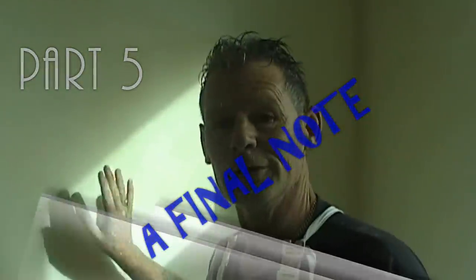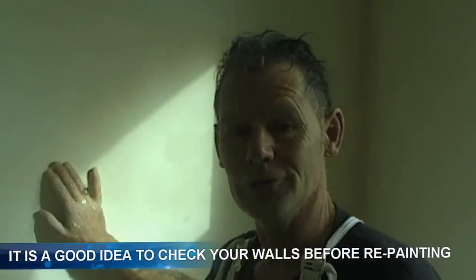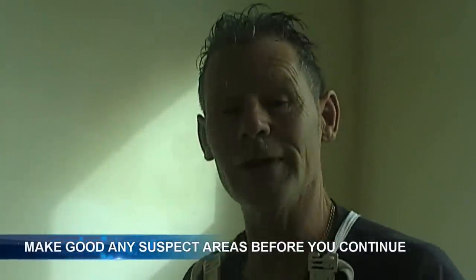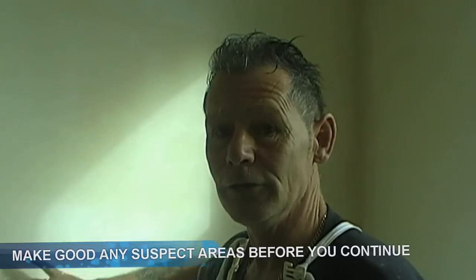There is a specialist interior ceiling and wall paint you can purchase that's already formulated to paint directly onto plastered or textured ceilings and walls. So you can buy a product already, but the way I use it, I use the emulsion, the colour I'm going to use, and I'll water that first coat down and roll it on and create a key, let it dry completely, and then do all the filling, any filling.